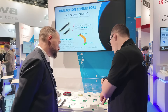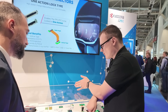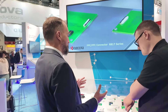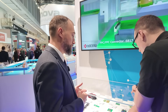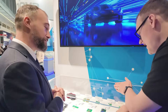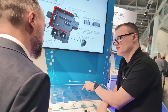Another item that caught my eye are the capacitor holders. Usually you just solder components in — so what application asks for a holder and why does it give an advantage? There are two cases. The first is customers wanting to get rid of the manual soldering process or an additional wave-soldering step just for one through-hole component. The capacitor holder is SMT — you assemble it via pick-and-place, then later use a basic mechanical press to insert the capacitor using a cold-weld press. Wave soldering is expensive and often incompatible with double-sided SMT boards.